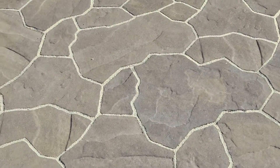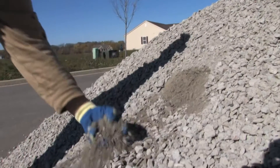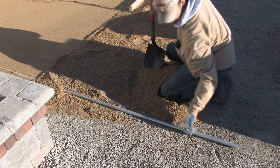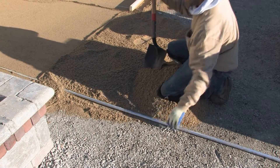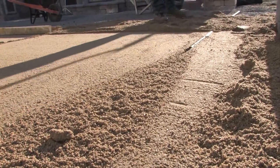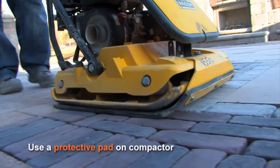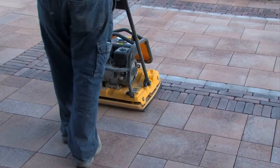Dummy grooves or false joints like the ones in Avante Ashlar and Trevia need only be one-quarter inch deep. Before using EasyPro, it's important that the pavers or slabs are installed on the appropriate base material and bedding course to minimize joint movement. Because EasyPro Jointing Compound is permeable, you should always ensure that the base material consists of proper free-draining material with adequate load-bearing capacity for your application. Also, make sure that you have completed the final compaction of the pavers before applying this compound. We always recommend a protective pad at the bottom of the compactor. Do not compact the pavers after applying EasyPro into the joints.